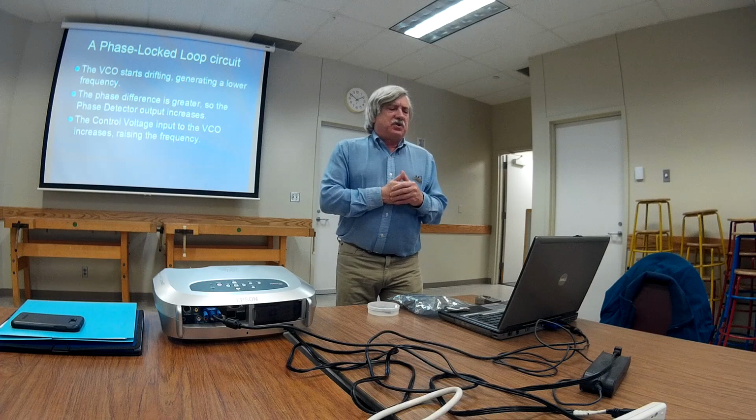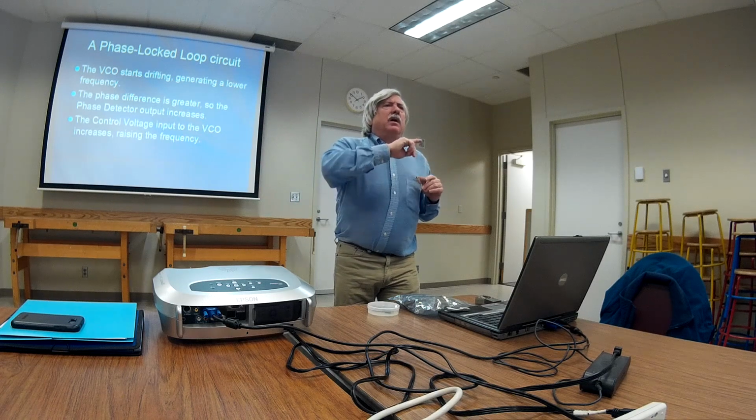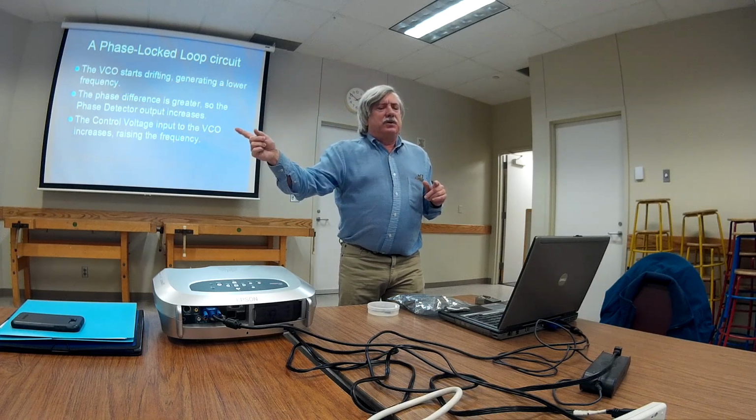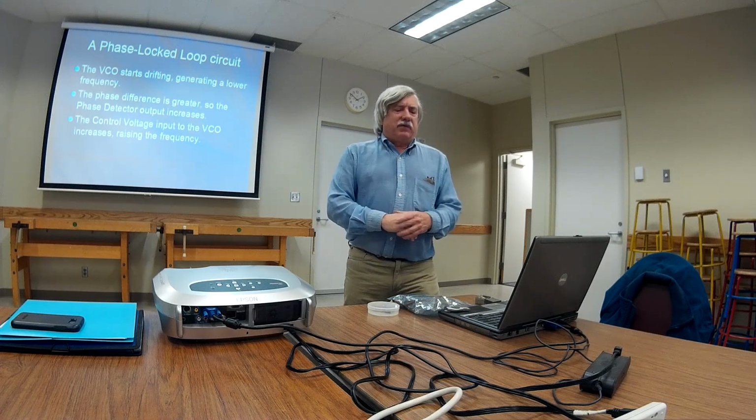Okay, let's go through that one more time, because we're going to do something here. Okay, the VCO wants to generate a lower frequency. The phase difference starts becoming greater. The phase detector puts out a higher voltage to compensate for it, which will increase the frequency of the VCO.